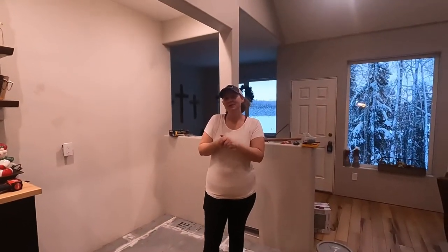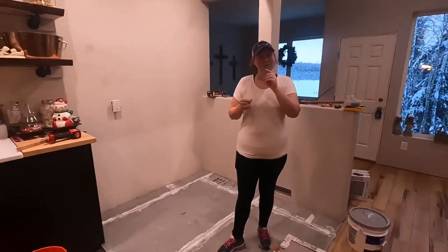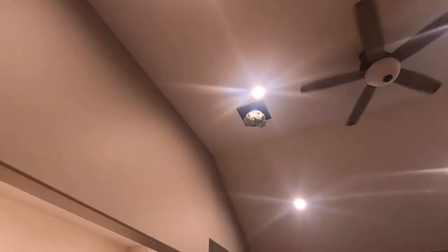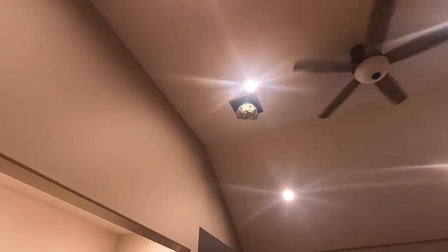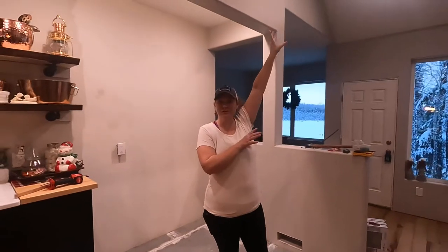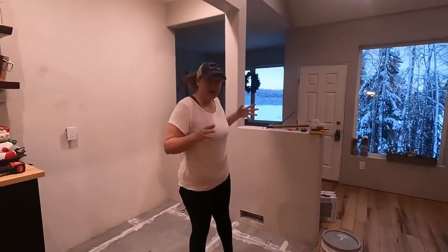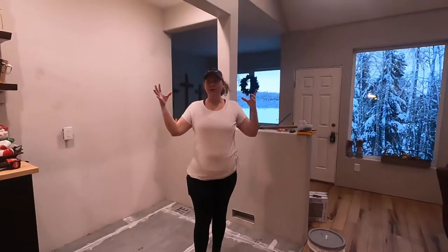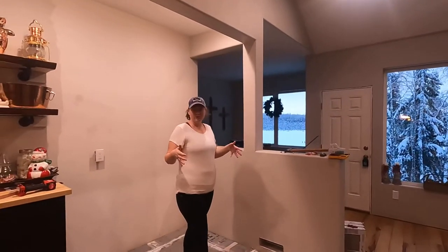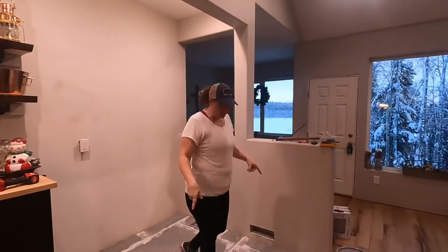Here we are in the area where the wood cook stove is actually going to go. Something we had done in October was we had the stove in the basement put in. If you look up here, this is where the wood cook stove is going to vent out. It has gone through the attic and everything on the roof is all done — there's triple wall pipe up there, it's an insulated pipe. The house wasn't originally designed for a stove like this, so we moved this wall and put in this wall. We added this whole area in order to have the wood cook stove be a centerpiece from when you enter into the hall, and it's also centrally located for heating the hall. Aaron and Caleb already did the underlayment.